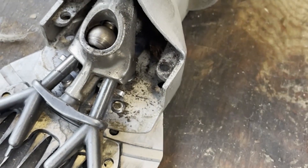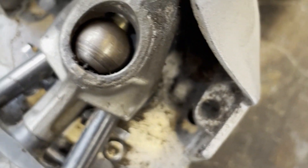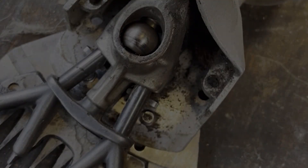What was happening is we used a new oil can, and that oil can was not pushing through here. So this was completely plugged — the oil wasn't going down in there. That ball got too hot and it has a groove in it or something. So I'm going to go ahead and replace that ball and see if that fixes the problem.